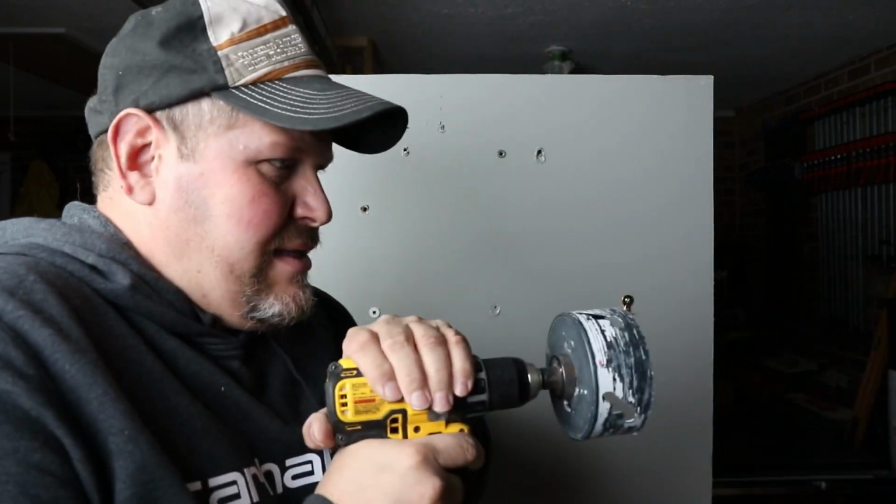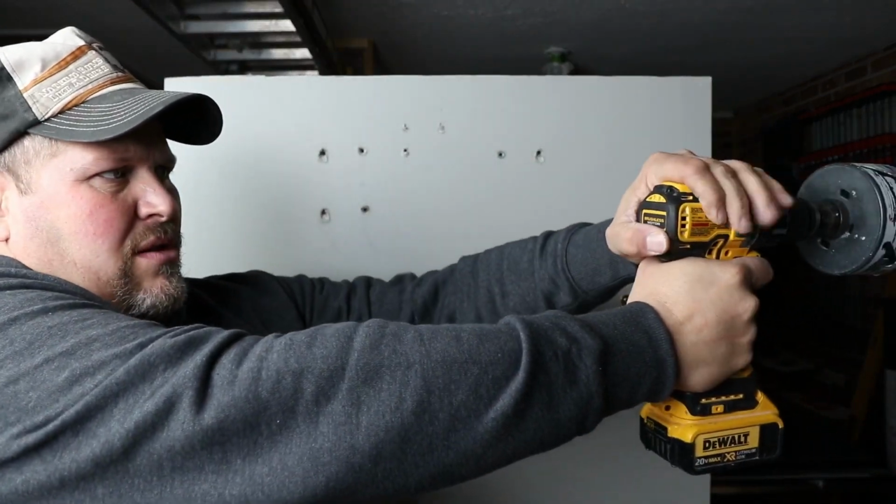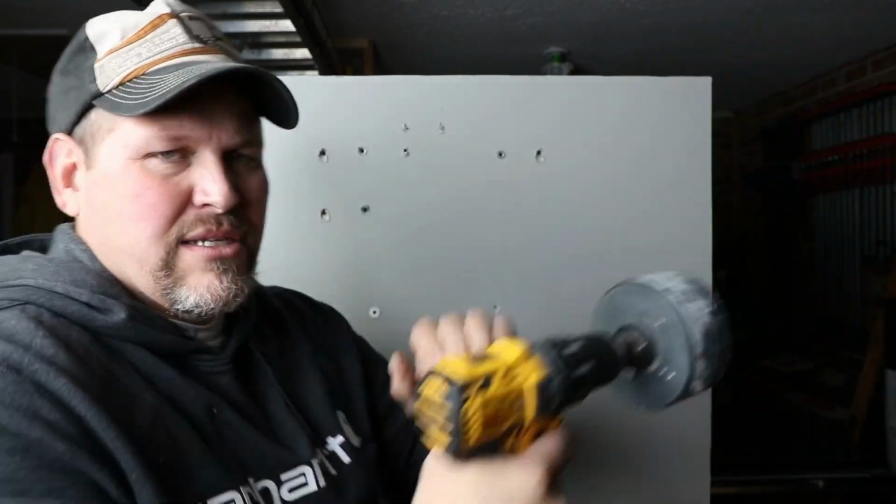Hole saws. Okay, so just be forewarned that 3-inch and larger, they can be a bit of a chore to hold on to. Lock that thing into your body, tip it in really lightly into the drywall, rock it in, bam. You won't have any problems. If you do it like a pro, don't do it. Let me readjust. Let's not be doing the hole saw way out here, because you're going to be everywhere, and next thing you know, you're going to be in the ER. We're not going to do that. We're going to lock it in. You're like, oh, it's so close to me, I don't want to do that. Well, trust me, it doesn't work that way.